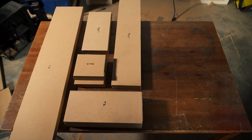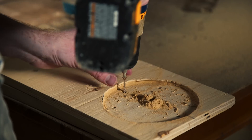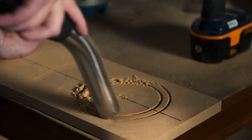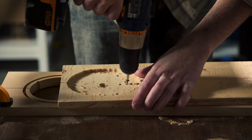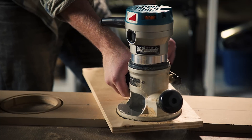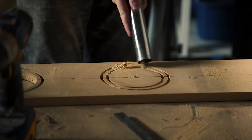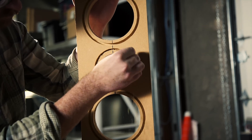Anyway, once we cut all of our pieces, we needed to put holes for the woofers and tweeters in the piece of wood that will be the front of the speaker. I'm sure there's a specific name for that piece, but I don't want to baffle you or me with too much audio terminology, so we'll just call it the front. We used a router and a jig to get the circle cuts and recesses. If you want tips on how to make your own jig for doing circular cuts like this, check out the link.